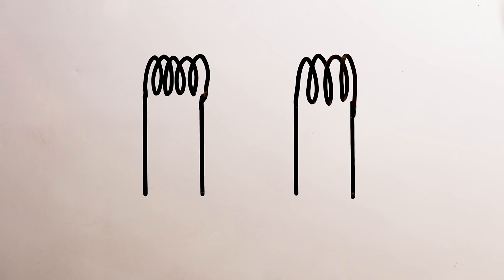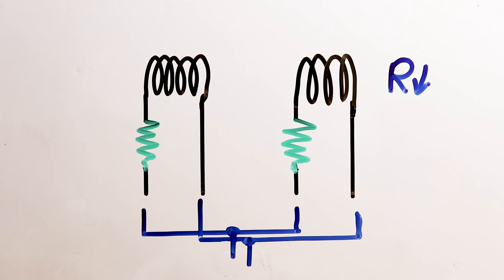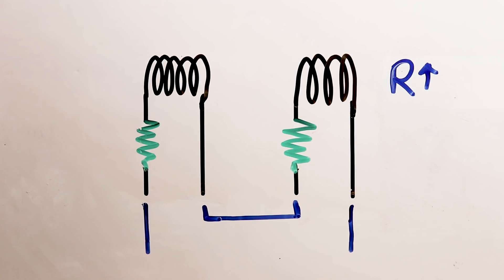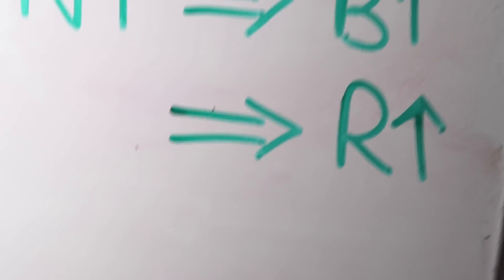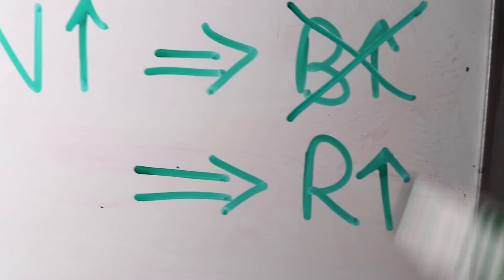But the temperature became way too hot. This has to do with the fact that the coils have a serious resistance. Connecting two coils in parallel results in a drop in resistance, which means more current passes through the coil, increasing the magnetic field but also raising the temperature. Connecting them in series results in higher resistance, which lowers the current and thus lowers the magnetic field strength. Theoretically, adding more turns should increase the field, but in practice this also increases the series resistance, which doesn't allow that to happen.